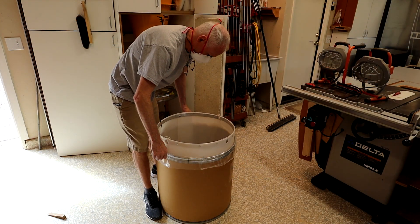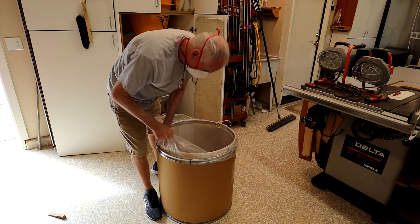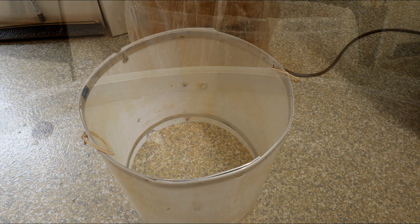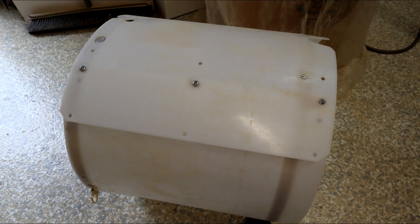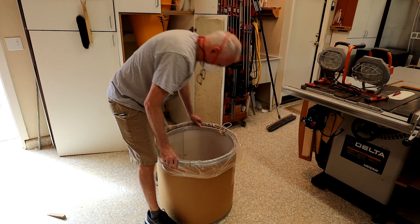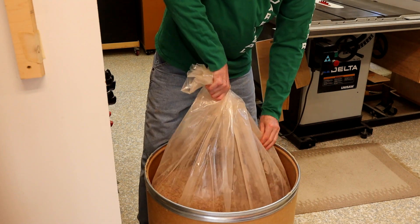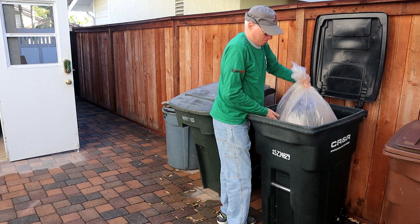I occasionally had issues with this system too. The plastic cylinder would collapse, and my liner bag would end up in the filter. I modified their plastic cylinder sleeve by adding rings to stiffen the whole thing up — just an eighth-inch aluminum flat bar that I bent and attached with some screws. Finally, my bag-sucking nightmare is cured. Once the kinks are worked out, you can just pull the bag out and drop it into your trash can. No mess, no fuss.